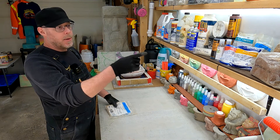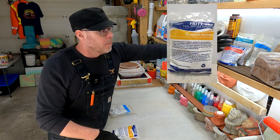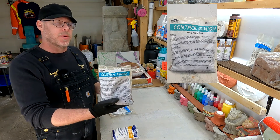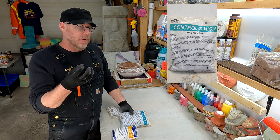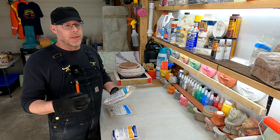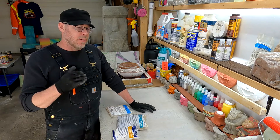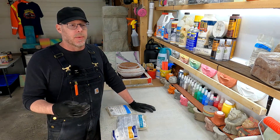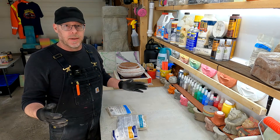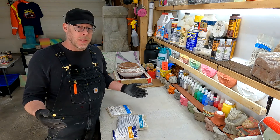They also make plaster products specifically — things for augmenting pool plaster mixes. But they also make products like Control Finish, something that's going to allow you to raise cream better to the surface when you're flat finishing concrete, and it's going to help reduce evaporation at the surface level due to crosswinds. These are very important, integral components of working with concrete professionally. All concrete professionals would work with something like this, but the average enthusiast or do-it-yourselfer working at the benchtop level has probably never heard of most of these.